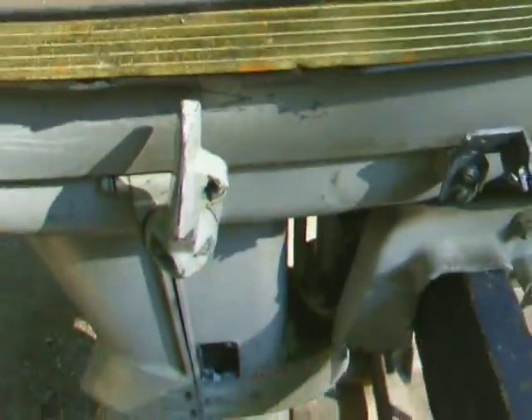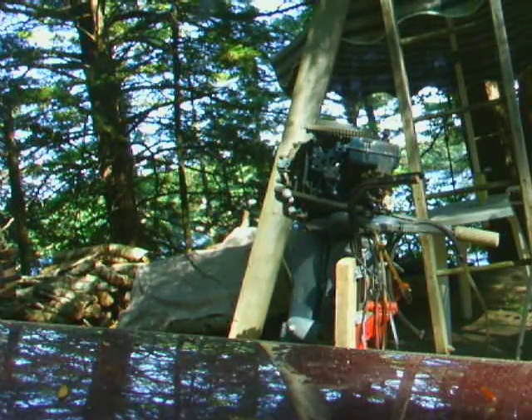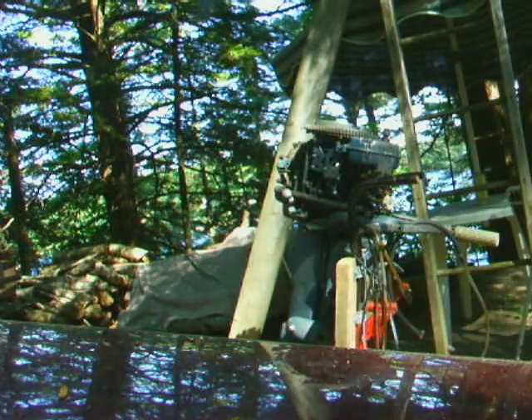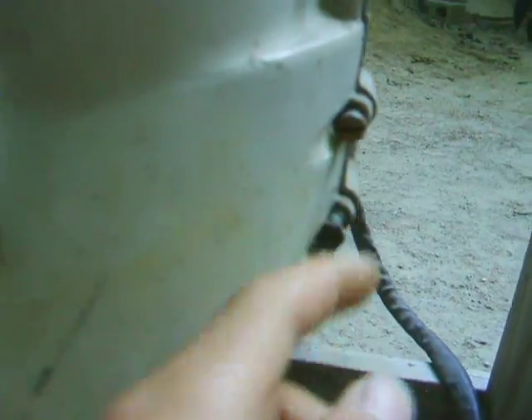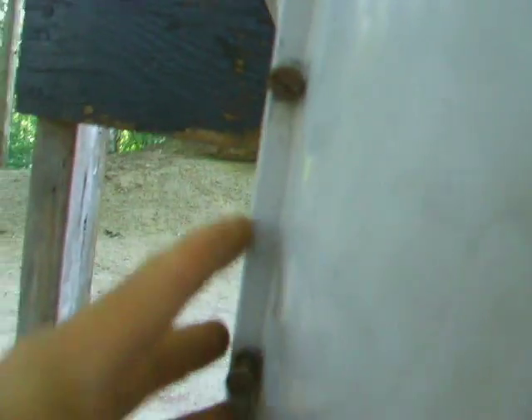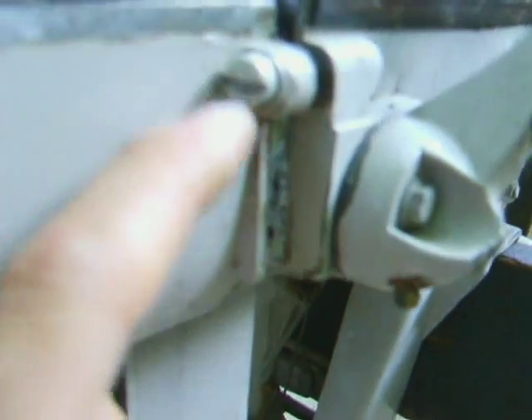There's no wiring harness. I'm going to get this cover off. I managed to get all these bolts off without mishap. I wonder if these are all original — the two up here are slotted and painted, original. But down here I have three slotted and one hex, then two hex and three hex. Five of them are slotted hex, one is not. According to the parts manual they should all be Phillips screws. This appears to be original — a white screw, so they all should be like that. These are stainless steel but they're rusting on the heads, so I should try and get those replaced.